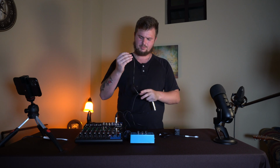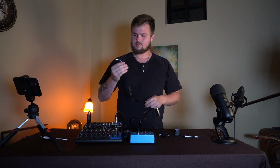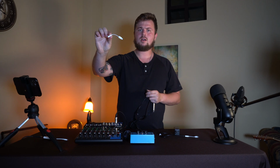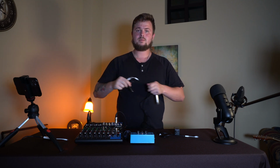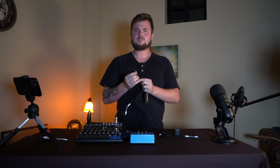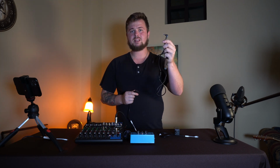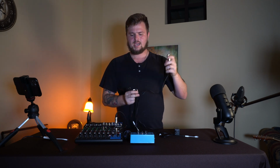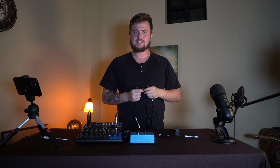Now basically what you're going to need is 3 separate adapters for you to plug in your dynamic microphone into your smartphone. The first one is for iPhone users, and it is the Lightning to TRRS adapter. The second one is the TRRS splitter, which separates the headphones from the microphones. And finally, you're going to need a 3.5 millimeter TS to XLR Female adapter. This is a very specific cable, so I'm going to link it in the description in case you need one of these.